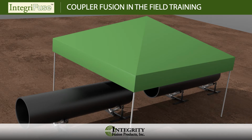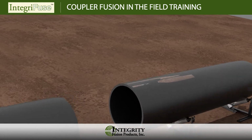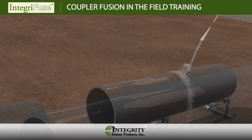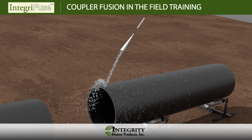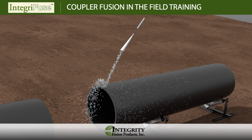Do not proceed with the fusion process if there is any water coming into contact with the fusion area, since this can have a significant impact on the quality of the fusion joint. If installed in an excavated pit, the technician must ensure that the area is adequately exposed and free of mud and contaminants. Initial cleaning of the pipe ends can be done using water. Always remain at the fusion site and observe the fitting during the fusion process as a general safety practice.